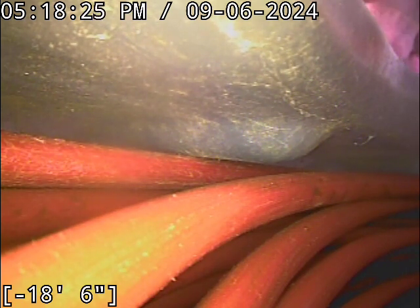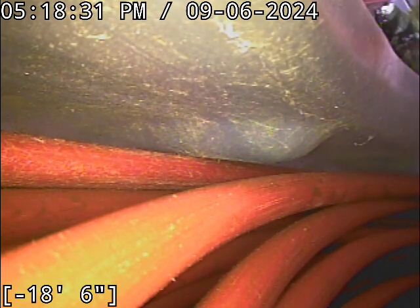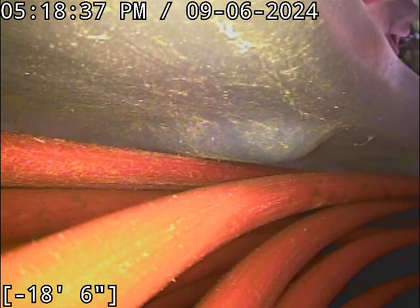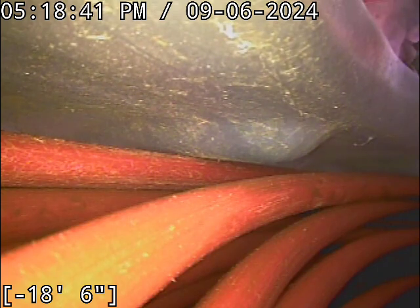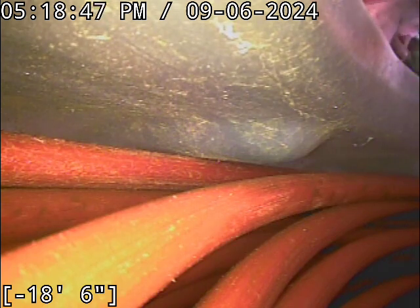You want to re-scope afterwards. A lot of times you end up with decent-looking metal on the other side that's got plenty of longevity left in it. But other times you strip that layer off and start uncovering pipe where it's channeling — where the metal is eaten away. Right now I don't know if it's at that point yet. I want to take a look at it in better lighting, but I may very well recommend that. All the updated pipe looks great, drains beautifully, is super clean. Overall the line is functioning at this time, but that cast iron — I may recommend something be done with it.